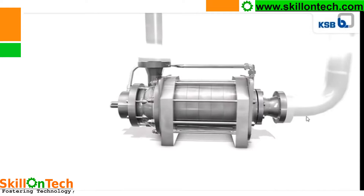Here you can see this is the suction nozzle. This is the casing of the pump. These are the stage casings. This is the discharge pipeline. This is the rotor. The coupling will be installed here, and this coupling will be connected with the prime mover — an electric motor. And these are the tie bolts.